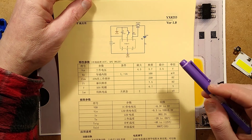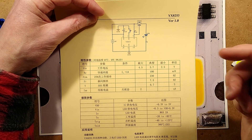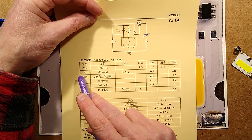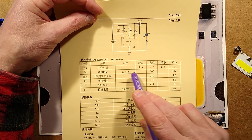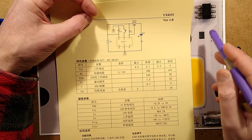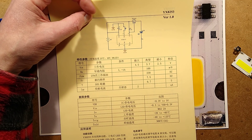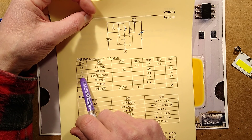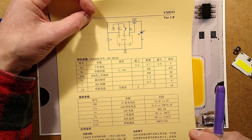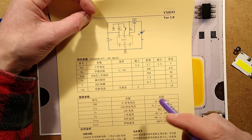The quiescent current was so low I couldn't even measure it — it was actually less than one microamp. The on-state resistance at one amp of the internal MOSFET that switches the LEDs is 100 milliohms, just a tenth of an ohm. The low setting is a 25% duty cycle at 230 Hz — you can see a slight flicker but it's not that bad.